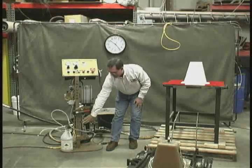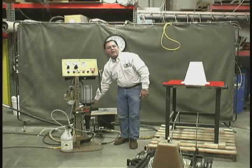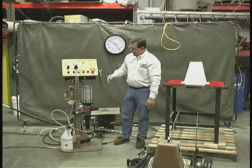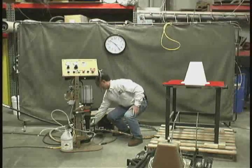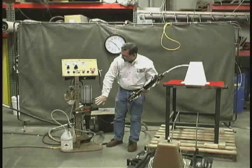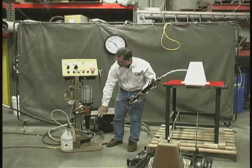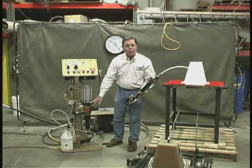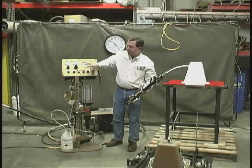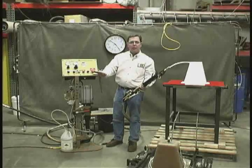We have a stainless steel catalyst pump and a 100cc resin pump, mechanically linked together. There's a five-gallon stainless steel tank holding the solvent, and then we have our mix head. I'm showing you here a seven-to-one pump ratio — this is the size of the air motor relative to the resin pump. We also have an eleven-to-one for a little more horsepower when needed. That configuration is common on the Aviator as well as our flagship machine, the PRG, which is fully automatic. This machine, again, is semi-automatic.